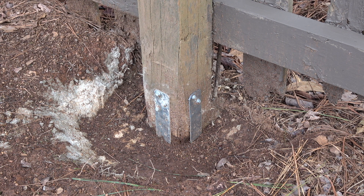Go to the hardware store, buy brackets like you see here, put them in the ground, screw them into the post, and you have the option of using 10, 20, or 30 pounds of cement. And that is your fix on rotten fence post in five minutes. We wish you luck.